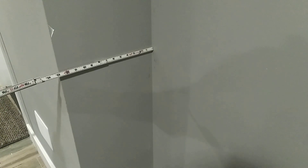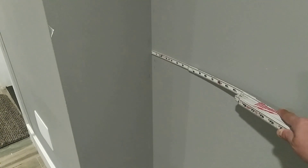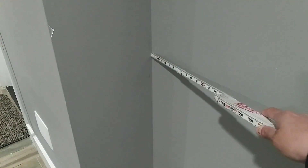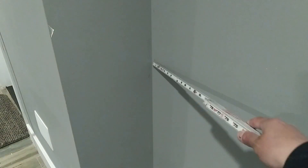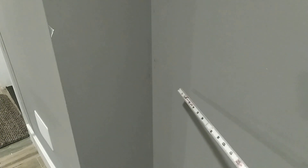Let's say it's six inches away to the edge — so your first offset would be a six-inch offset. Then you measure again to the other side of the edge to where you want your conduit to land. Let's say it's eight inches this time. So you have a six-inch offset from this to this edge, and then another eight-inch offset from this edge to where your conduit is supposed to land. So you have two offsets basically. That's how you measure for that.